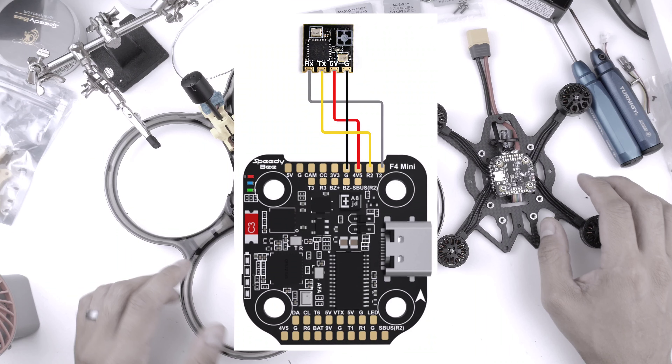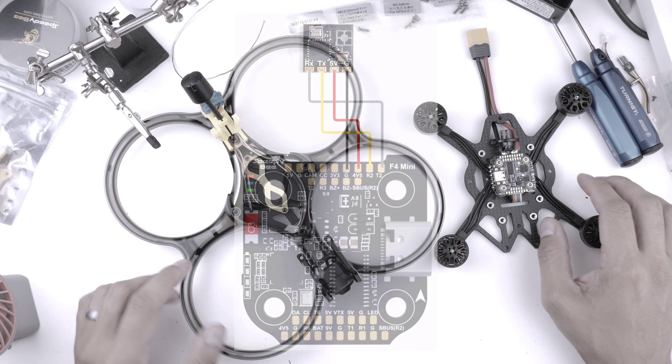Editor's note: Although the wiring diagram shows the correct way to connect the receiver, the wires weren't checked for length to fit this frame. When trying to put it on later, the wires don't actually reach, so it has to be undone. This is something that could catch others out too — always check wire length before soldering.